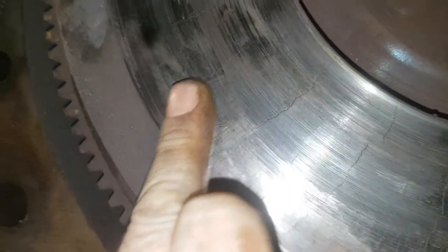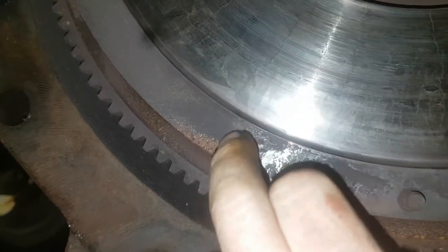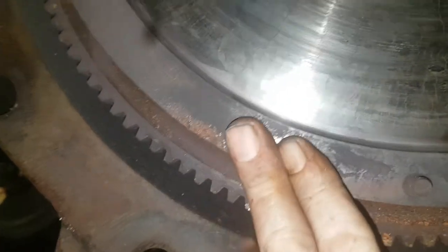Last but not least is the clutch. The clutch was in a pretty bad way and disintegrated. There are a lot of fractures and a lot of cracks in it, and it ain't round — it's not flat across here anymore. So if I get a new disc, it's only going to be touching it in points, and that's going to slip and not last very long. The plan is I might try and get this resurfaced — send it to a local machine shop and get them to run the lathe. Whatever they take off here, they're going to have to take off here too, because this is the part where the pressure plate will land, and if they take too much off, then the pressure plate isn't going to apply enough pressure.